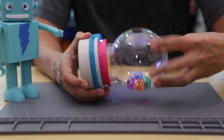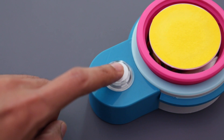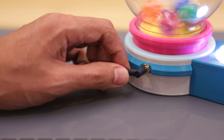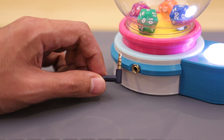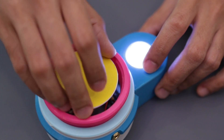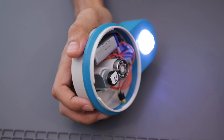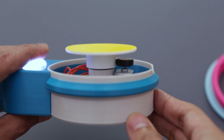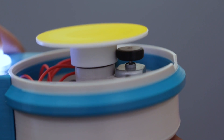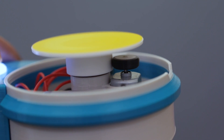Dice fit inside a clear plastic snow globe that can twist on and off, making it easy to use. An LED arcade button makes it fun to press, but it also features a jack for AT switches so it's built to work with other assistive tech. Behind the rotating platter is a DC motor and ball bearing. A 9 volt battery powers the circuit and allows the motor to spin whenever the button is pressed. A 3D printed wheel attached to the shaft of the motor rotates an axle under the platter, and the inner ring of the ball bearing is mounted to the base while the outer ring is press fitted over the platter.